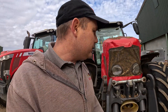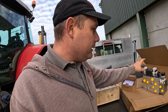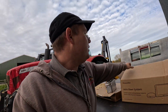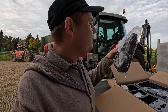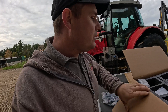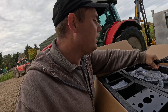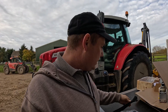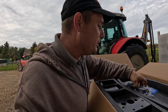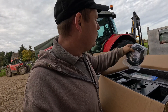We will go around the tractor and select a suitable mounting point for it. Then it's just about wiring, piping the pipes to everything, and then plugging it in, connecting it to the computer and the screen. So it's going to be a bit more work. Let's see what's in the box here. We've got a battery connector, a mounting point for the dome, and an angle sensor. I believe you do need to use an angle sensor with this one, with a steering wheel — though I might be corrected on that. That is your antenna for your SIM card.